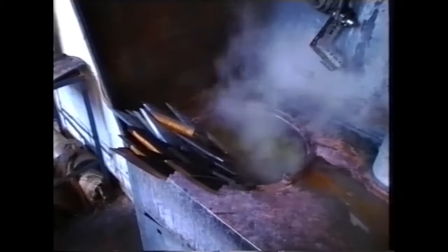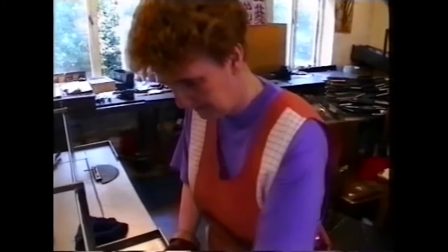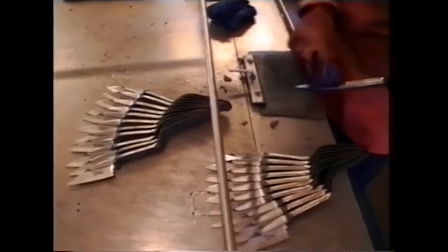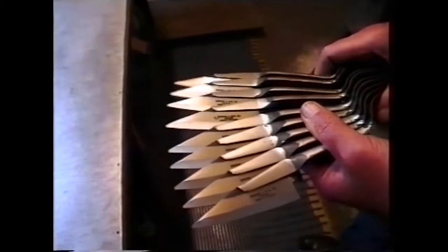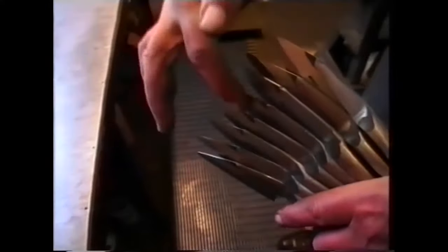After whale edging, they again go in the boiler and they're cleaned off, ready for the second examination. Now we're looking at the width of the whale edge, the shape of the whale edge. We're looking at the quality of the glaze, the quality of the mark. We're looking at the shanks as well, to see that they're not burnt. We're looking at the backs to see that they're polished, so that they'll go down the fleece better.